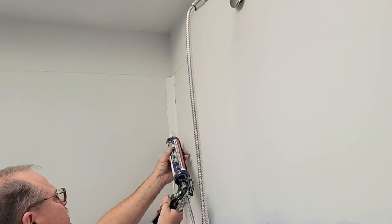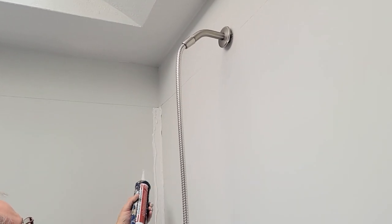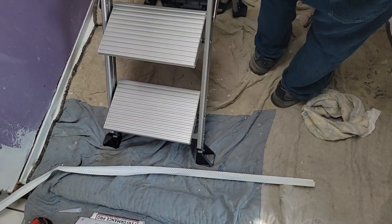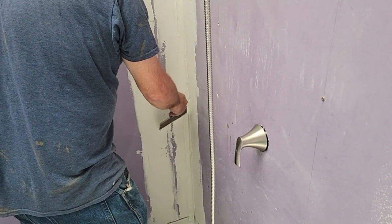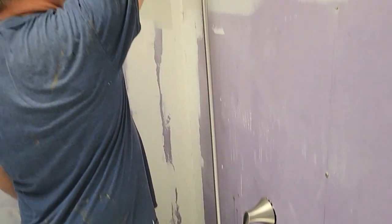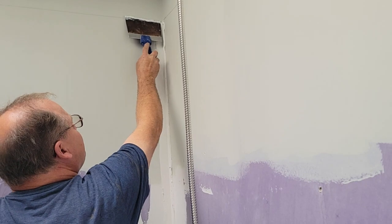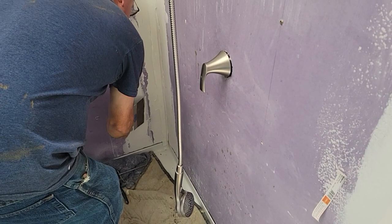These are the reinforced corners — they're very heavy, you can't rip them unlike drywall corners. This is for the flex stone. This is a waterproofing, almost like a membrane, but it's a quarter inch. You put the mud in, it gives you adhesive in the kit — really good stuff like this. And you're sealing the corner. We ran the level line around the top, trying to get a nice square corner.